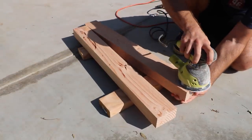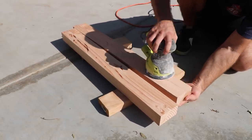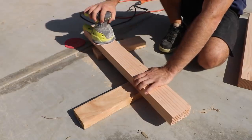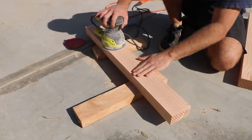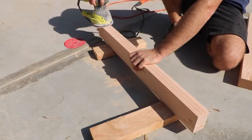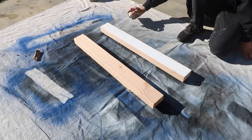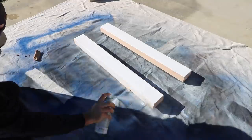I took the two beams outside and sanded them all the way to 220 grit. This smoothed out any imperfections from the table saw cuts. I also added a much smaller round back into the two corners that will not be against the wall. These guys got painted the same color white as the door. I should mention that I used semi-gloss paint for all of this.